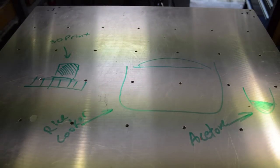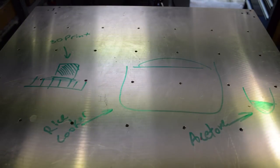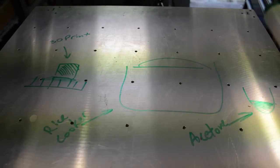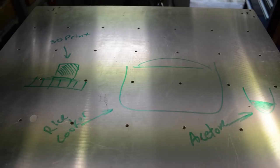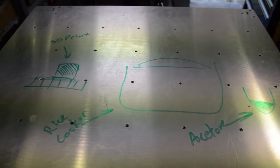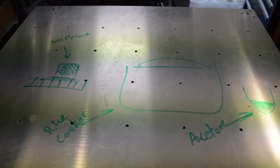Here's my secret recipe for getting awesome smooth 3D printed parts. Before we start, we need two things: the 3D printed part has to be quite cold and the rice cooker needs to be quite warm. The vapor has to condense onto the 3D printed part to smooth it properly — if it's too hot it won't condense well and you get a crappy smoothing surface. Keep the 3D printed part in a cool room or the fridge for about 10 minutes, and preheat your rice cooker with nothing in it for about 3 minutes.